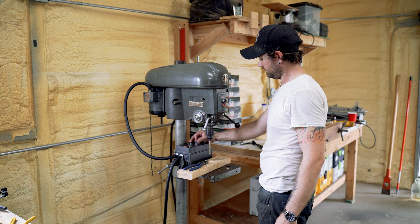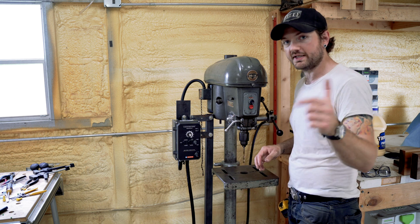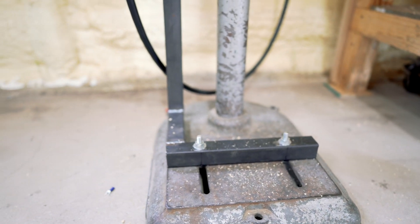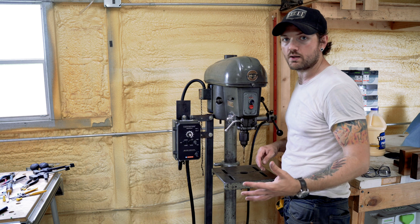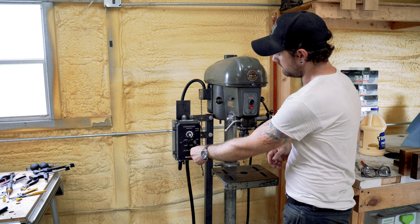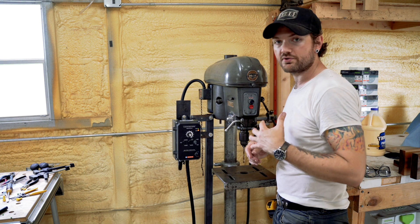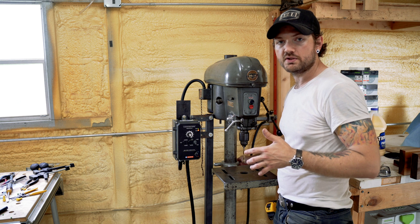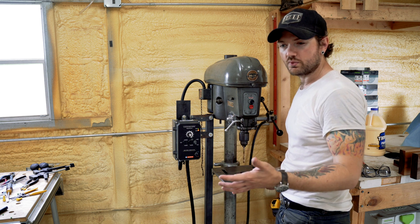Way more stable. Very simple — I just welded a new base that attaches to the platform. I used the same bracket because it will still allow me to mount the light I want later. I just attached it with some 2-inch quarter-20 bolts. The only problem I see right now is that the raise/lower mechanism for the table is very close to the stand I've made, so we'll just see if that gives me any problems.